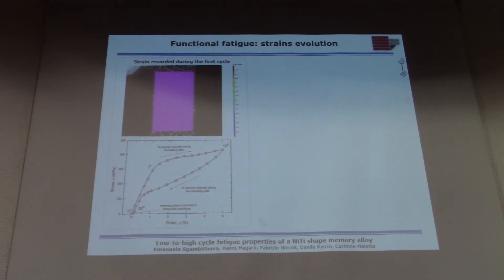From the global point of view, for example, we analyze the strain evolution in a single cycle when load is applied — reading the stress-strain response from the load cell and physical extensometer. But if you want to evaluate how the strains evolve locally during loading, digital image correlation is a very useful tool, as shown in this video clip. When you apply the load, you get martensite bands — almost like Lüders-like bands — and with DIC you can also analyze the residual martensite and the accumulation of martensite bands inside the material.